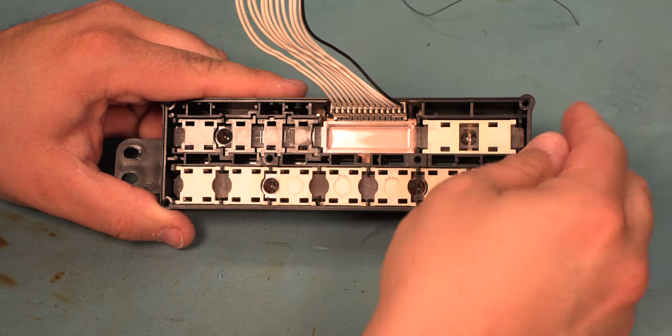We're going to remove the four capacitors, and to do that, we're going to use a small wire brush. This is a brass bristle brush. We're going to brush away some of the conformal coating on the back of this circuit board. It comes right off with either alcohol or with a dry wire brush. Okay, to remove those capacitors, we're going to heat each of the joints on the back side